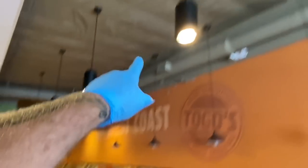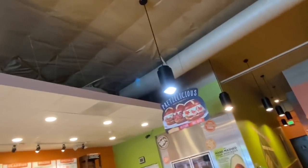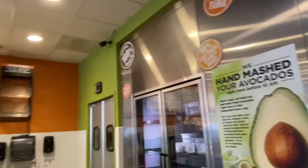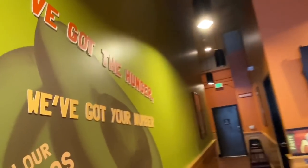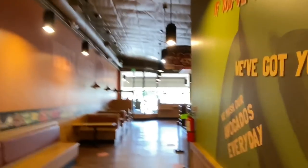So this is the registers for that unit. That's the supplies. What did they do? Oh, there's the return. It's almost like a residential. It's got one return right there. You're kidding me, right? That's it? One little return. I think that's a 4-ton unit. Might be a 3-ton, but I think it's a 4. Yeah. Typical. That's what you get. That's my return air. I can't believe it.